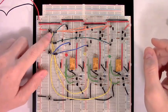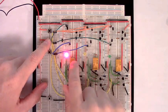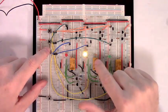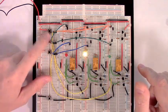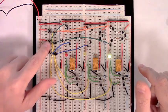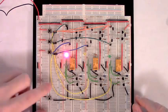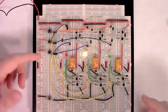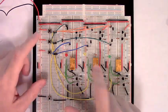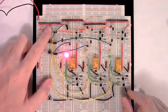Turn the power on — we should be able to press momentary button A and have relay circuit A come on. If we press momentary button B, relay circuit B should come on and A should go off — and it does. We press momentary button C: relay circuit C should come on and relay circuit B should go off. We should be able to go in any order so that only one can be on at a time — they're mutually exclusive. If one is on, the other two are unlatched. To clear the one that's on, just push the master reset. We can start in the middle with C, jump to A, jump all the way to C, start with B, jump to A, and then jump from A all the way to C — in any order we want. And it works.